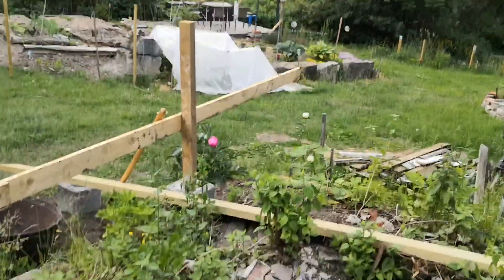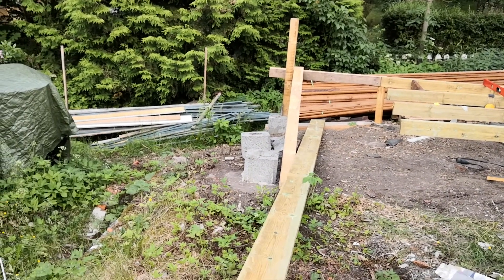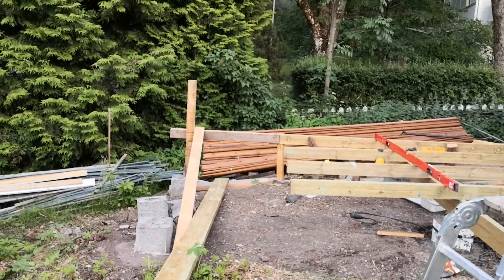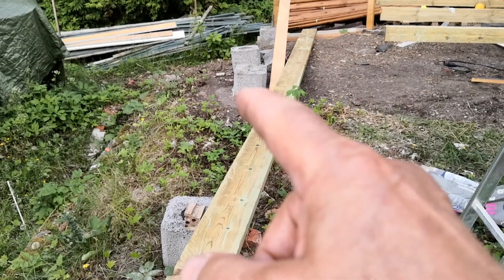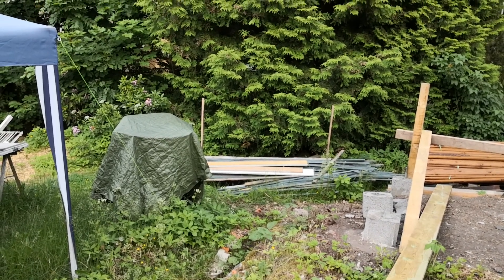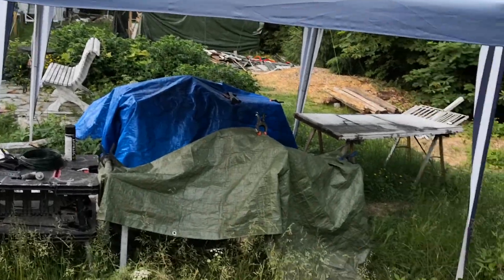It's a lot of work but it's coming along. I'll be carrying out the work on that side and then I'll be running joists — it's going to be 220 centimeters from that point out to the edge. They'll be hanging off this joist right here, overhanging by about a meter. But I'll have good support on that granite foundation right there — no problem at all.